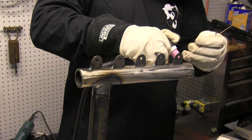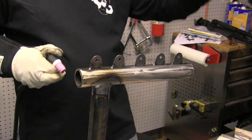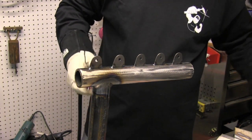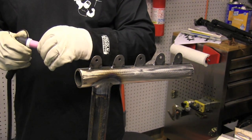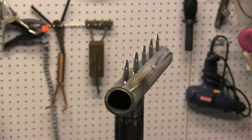That's something to remember when using a magnet or a MagTab — the next tab I'll put a little bit farther away from the magnet. I've extended it with the magnet way on the other side, then put a quick tack on with filler metal, and we can see how it goes in a little bit better — a nice little small tack. Of course then you just remove the magnet and put a tack wherever you want it. And see, I got them all lined up in a row, which would be a little more difficult to do by hand.